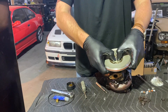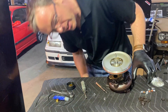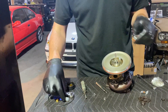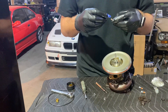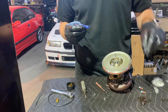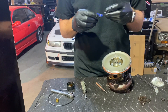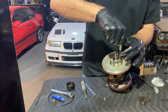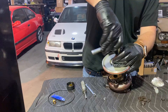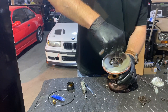Piston ring — make sure not to pop it up on the way back in. Make sure the o-ring is nicely seated in there — looks pretty happy. Let's get these bolts back in and a little bit of Loctite on them.